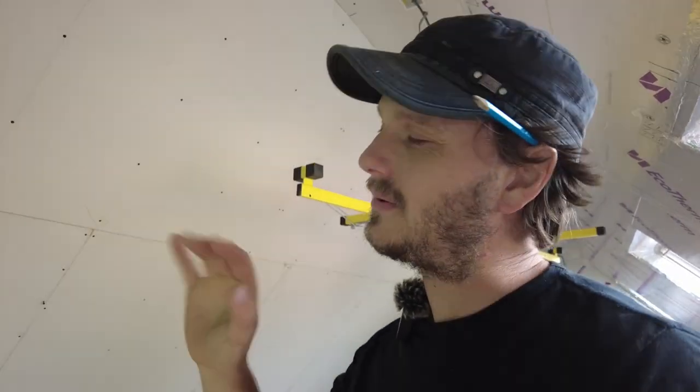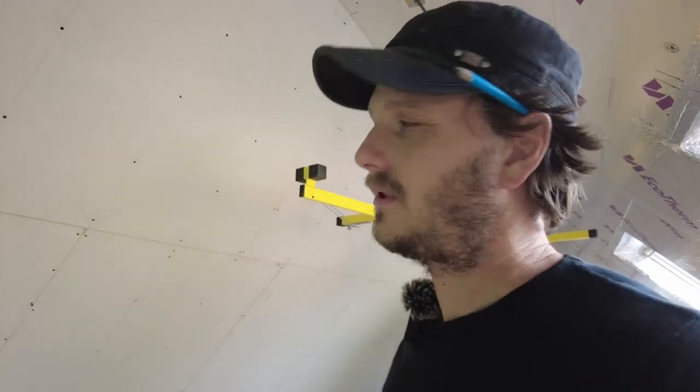I reckon you get away with that. 300 centers, you'd be fine. I suppose probably I would go anywhere between 200 to 300 mil in between my screws, and then you will be all good.